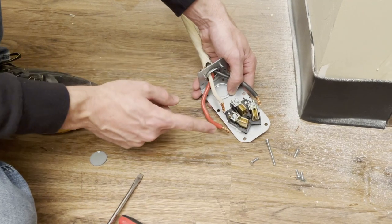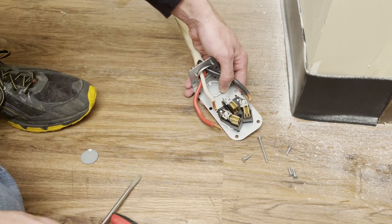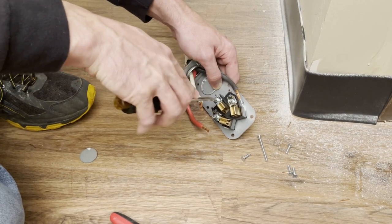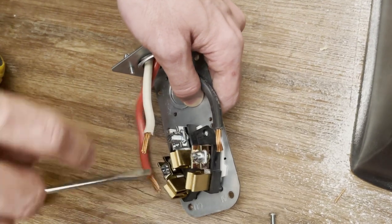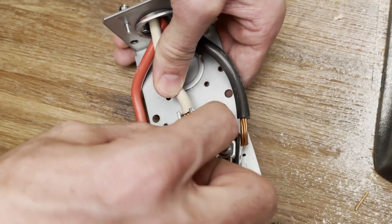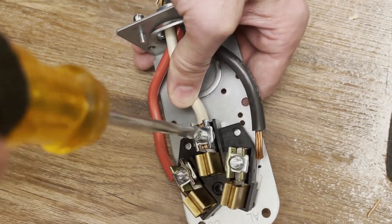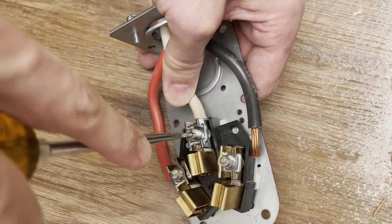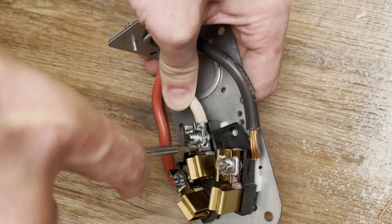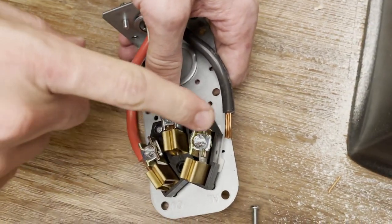We've got this screwed into the back and fed the wires through. Keep in mind the white, shorter one is the neutral wire that needs to go into the middle terminal. You're going to unscrew just to loosen this tab so that it slides out of the way, and this wire will sit in there. Close the tab and when you tighten it down it'll pinch that wire and force the tab up, which puts pressure on it and holds it in place. Make sure to get these snug and nice and tight so there's no chance of it becoming loose, because if these wires become loose they run a chance of arcing. We're going to repeat the process on both of the hot sides.